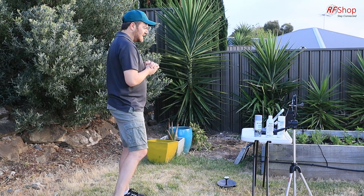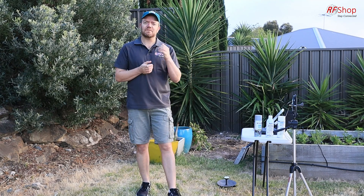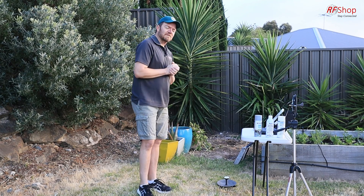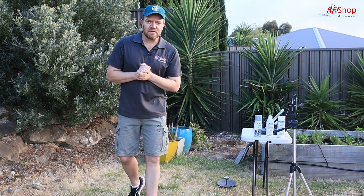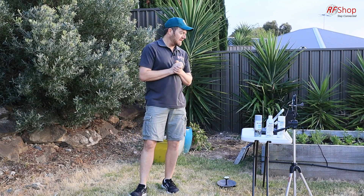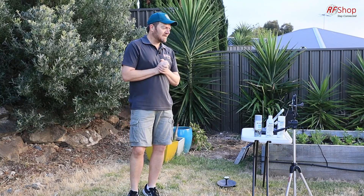I'm back in the original footage. This is now with the aluminium spray. We'll just have to do a side-by-side comparison with the previous one. As you can see, the aluminium spray is working quite well — quite a strong, heavy signal. It definitely works much better than the cold galvanized spray and it works better than the dipole as well. So that is a success — I'm happy with that.